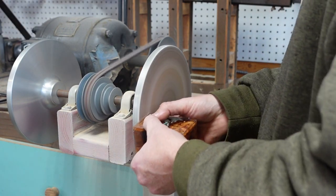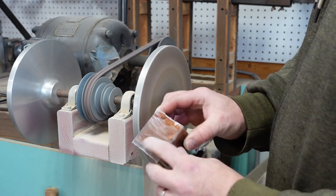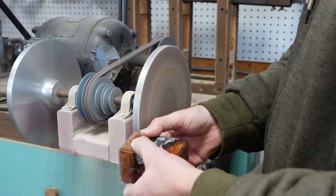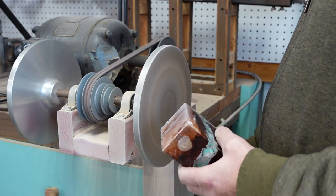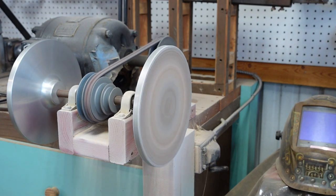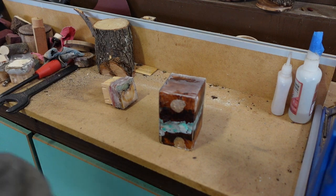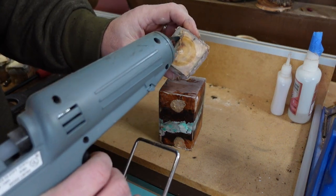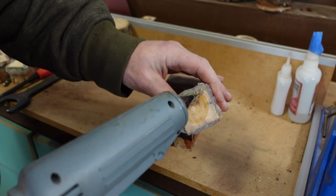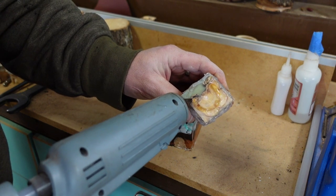After the mold's removed, I take the blank back out to the shop and hit the end with a thicker wood base on it to flatten it and add some adhesion. This way I can mount a sacrificial tenon to it. If you watch some of my other videos, then you know I use hot glue as an adhesive for holding and mounting small projects. I've used this method successfully many, many times over, and I just make sure to take care not to take too heavy and fast of a cut. Otherwise, it's possible to break the piece loose and toss it off the lathe.